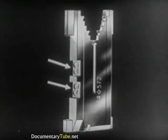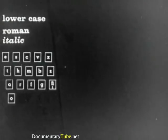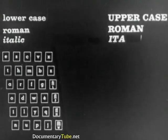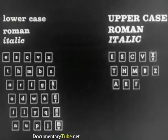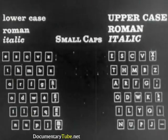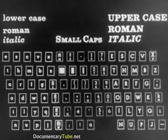Generally, a mat carries two letters, Roman and italic, or Roman and boldface. A magazine contains lowercase letters, Roman and italic, controlled by the left section of the keyboard. The upper case letters, Roman and italic, controlled by the right section. The small caps, numbers and punctuation marks, controlled by the middle section of the keyboard.